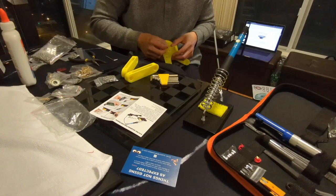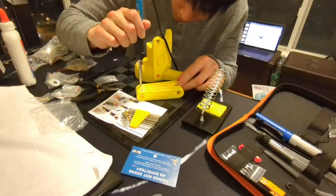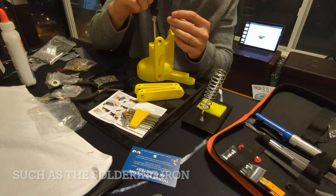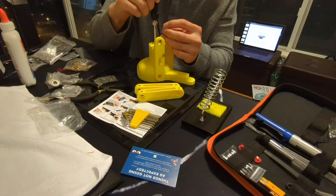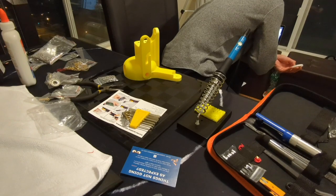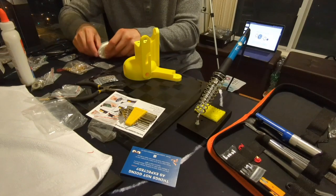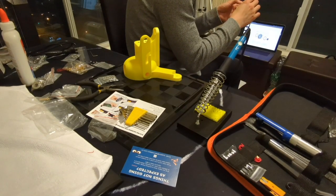The glue brings up an important point: there are certain things not included in the kits that you will need. I'd recommend finishing this video to see which tools you might need to buy so you have everything ready when the kit arrives. Also, heat inserts will occasionally get stuck to the soldering iron — using a separate piece of metal to push down the heat insert after the iron has pushed it in is a great way to ensure no heat damage to the plastic.